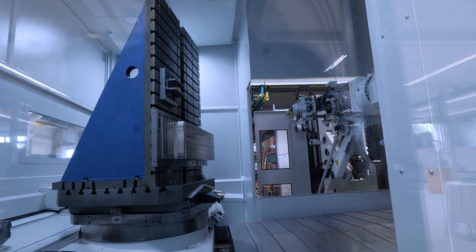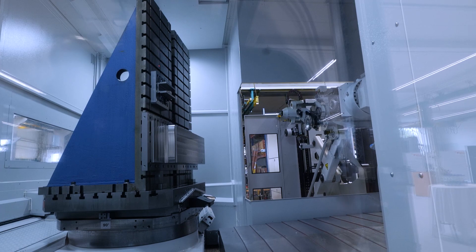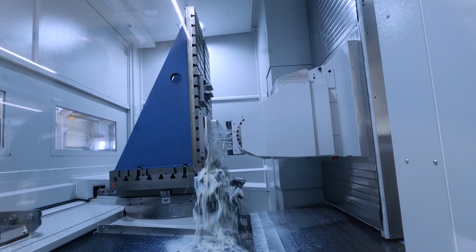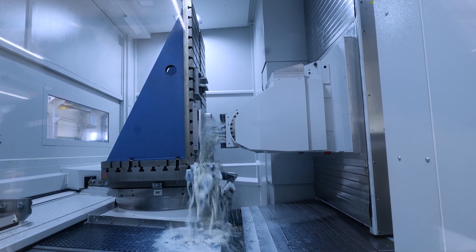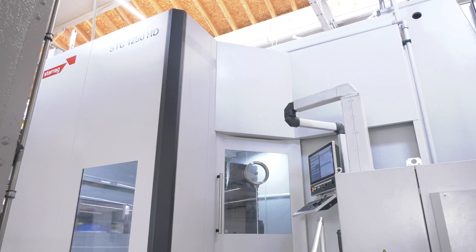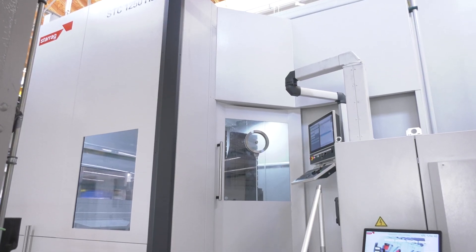The two real key things are stiffness and dampening. You've got components that could be a meter or more above the table, so there's an awful lot of bending moment. You need a very stiff machine but also the ability to dampen out vibrations through heavy cutting. We've got big porcupines and face mills on titanium — a difficult material to cut generally.